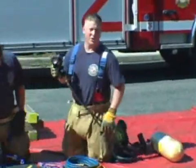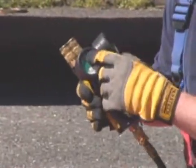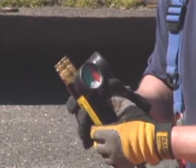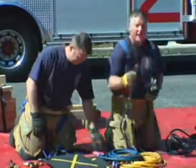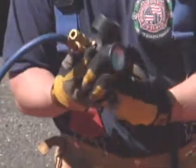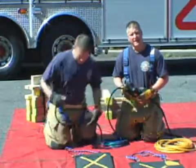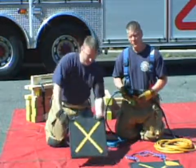A simple test to ensure that we have air is to depress both the activation buttons. When we do that, we see the gauge dial up, and we can relieve the air by pressing the down button. Now we want to move on to supplying our bags. We take our supply hose into one of the outlets, listen for the click, and screw the collar up. We take the female end and apply it to the airbag inlet nipple — again, we want to hear the snap and screw down the safety collar. At this point, our system is set up and ready for service.